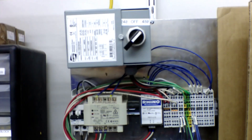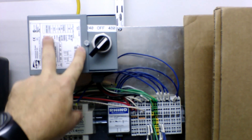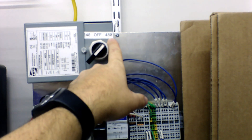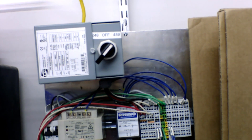This is actually my test setup. I have a single transformer which I've done some creative wiring inside to put a selector switch on, so that I can test 240 single phase and 480 single phase with a selector switch. And then I have 24 volt, 5 volt, and 15 volt.